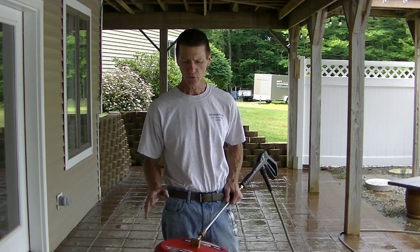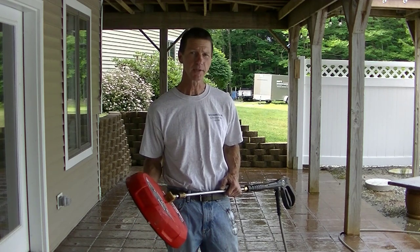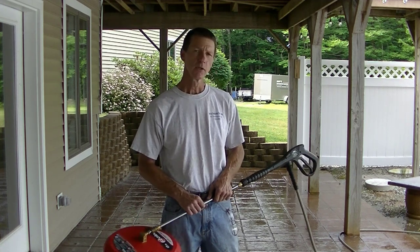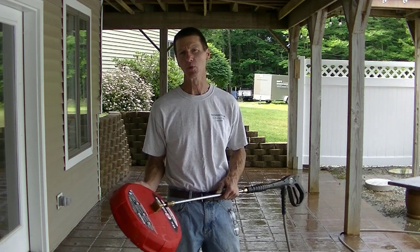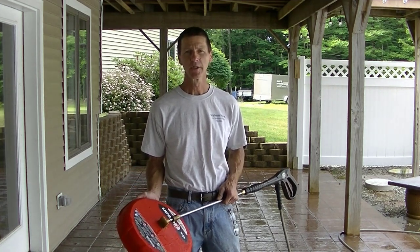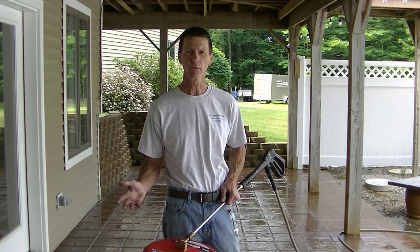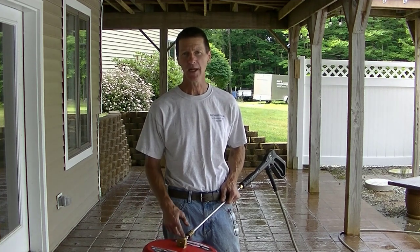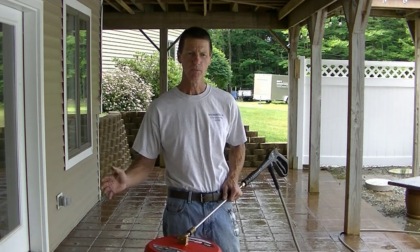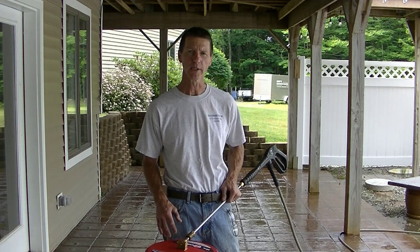So once you use the surface cleaner, the next thing you've got to do is rinse the residue off of the concrete to get it good and clean. Now, you're going to need between a 2500 and a 3500 PSI pressure washer. For most of you, you probably already have one, but for those that don't, I'll have a recommended one on the webpage and down in the description of the video. So what we're going to do now is take off the surface cleaner, rinse off the residue, and then let this thing dry for 24 hours before we can seal it.